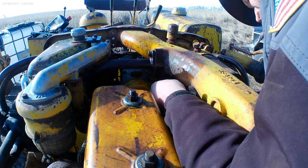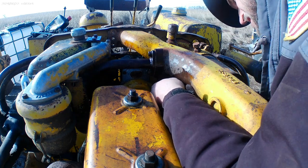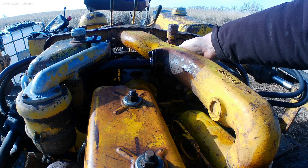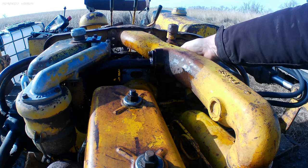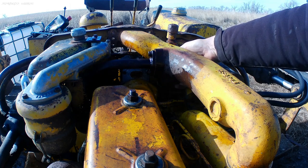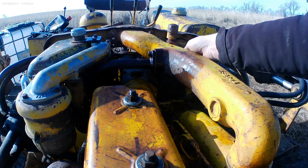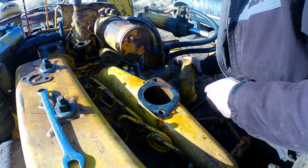For some reason, when it's warm out like this, I'm not nearly as salty. Just wait until I pinch my first finger — we'll get some salty moments happening, I'm sure. So what these are is they're where the pony motor exhaust runs through a tube inside the diesel intake, so that as the exhaust heats up, it heats up the intake air for the diesel. It's like a grid heater, but different. Let's not break that gasket, please. There we go — that air intake is off.